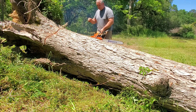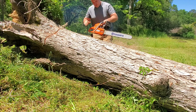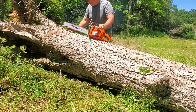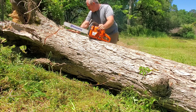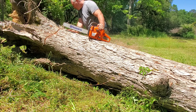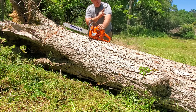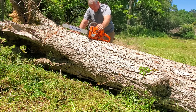She's free — I can see light going all the way through it. So again, the 365 — it's a good saw. I think this one's a 70cc. Very impressed. Pecan is very hard wood and it handled it no problem. I was putting it the full length of bar — all 24 inches of the bar into the wood — and she didn't really bog down at all.